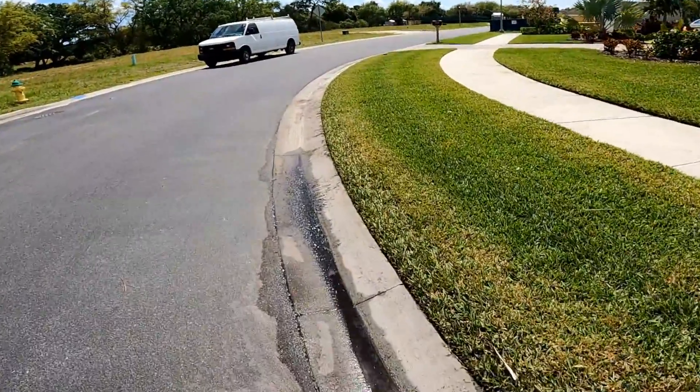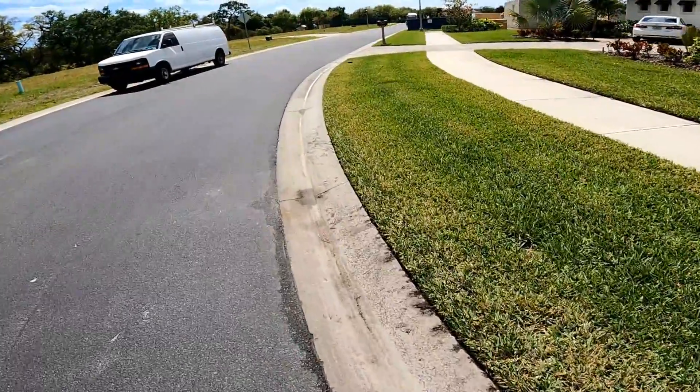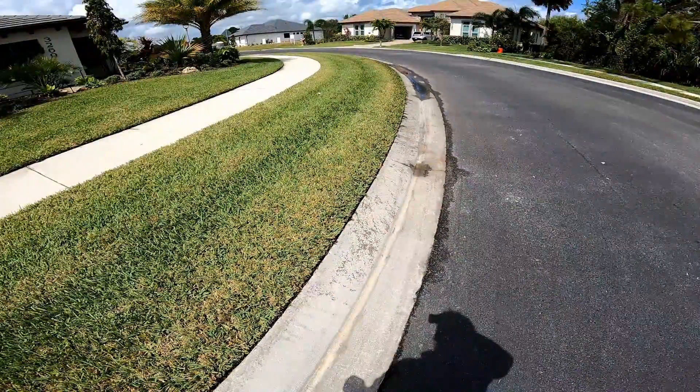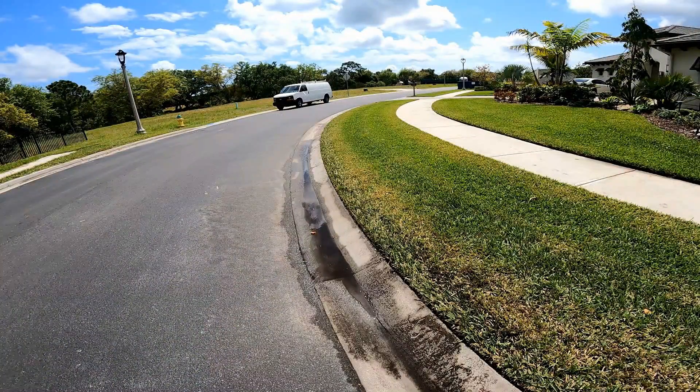Other people say 'we can just put a dry well in here' — that comes from civil engineers. It's funny because if you dig a hole here you're going to hit water. The groundwater is so high that there's no way you're going to discharge into another gravel system. The other problem is that this is on a low spot of the street — you can see all that water just sitting in the gutter, and that creates another problem.